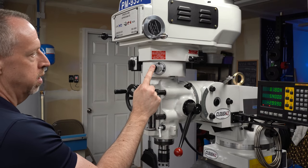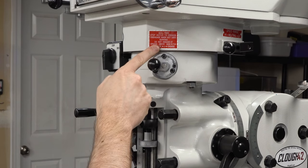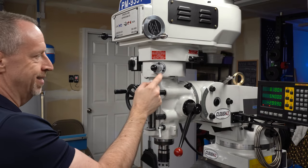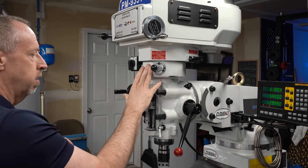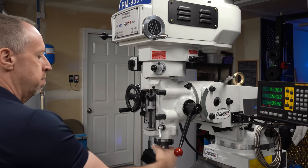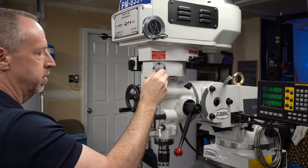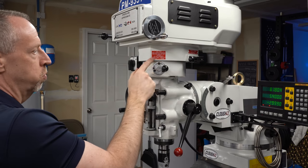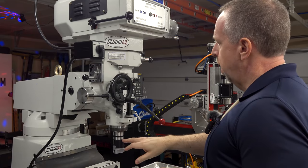The first control is the engage and disengage for the quill feed. Normally, this lever is left in the disengaged forward position so that the entire gear train involved in the quill feed is disconnected from the spindle. If you're not using it, you really want to leave it in this position so you're not incurring wear on the mechanism or accidentally getting it engaged. When you do want to use the quill feed, you pull this knob and rotate it around to the rearward position — this is a gear mesh, so you might have to grab the tool and rotate it to get the gears to align. With that engaged, power from the turning spindle goes to the gear train to drive the quill feed.